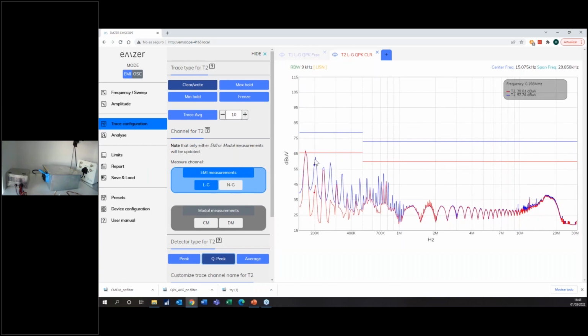So you would see, apart from this peak here at 200 kilohertz, sorry, it's practically the same. And here, well, something at 400, 700 kilohertz, it's giving more attenuation, the red one, but still not so much, not so valuable. What should I do? I should do what should really be done. Design a filter, use the filter kit of Würth, and really solve your problem.